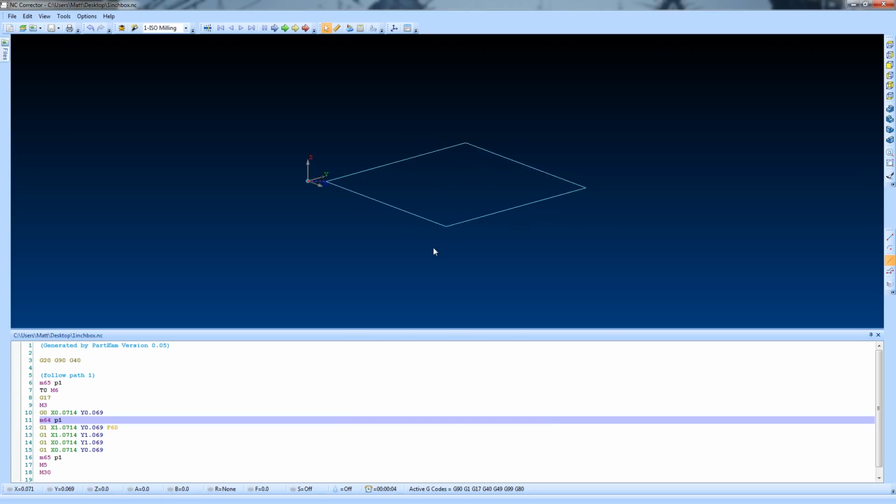We no longer have a z-axis, and that's completely fine. Our machine doesn't use a z-axis. Our z-axis for our machine is fixed. And so all we really did is we changed the G-code in such a way to make it workable with our setup in Linux CNC. And yeah, this is ready to be saved and put into Linux CNC so we can execute this G-code.